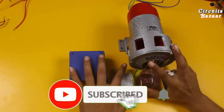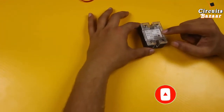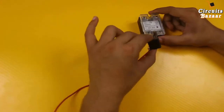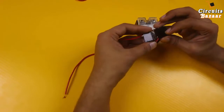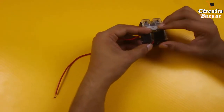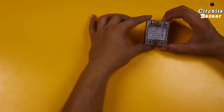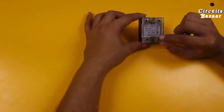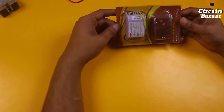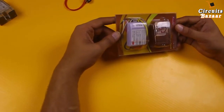The components we are going to use — I'll tell you one by one. This is the solid state relay. We can use a normal relay as well, like this one, but the problem is that this hooter requires very high power, so after some time the normal relay creates problems. That's why we have used a solid state relay. You can operate this relay between 3 to 32 volts. This is the wireless remote which you can buy online; it costs nearly 330 to 400 rupees.